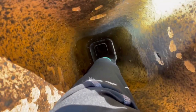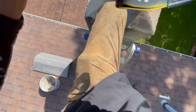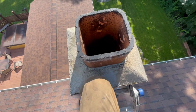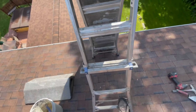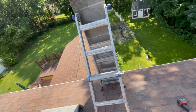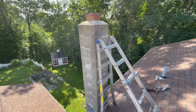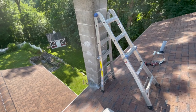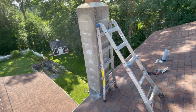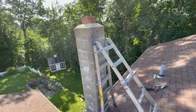This flue is actually a bit loose down here — see that? It's not even connected. The whole system moves because the mortar has been eaten out of all the flues. It was probably laid with regular mortar, and not to mention it's got a high-efficiency boiler on it. Anytime you get a high-efficiency boiler, it eats the mortar and they're supposed to have stainless liners, but the boiler guys don't install them — they just want to install the boiler. I see this a lot with Weil-McLain and Buderus boilers; they eat the flues and peel them on the inside.